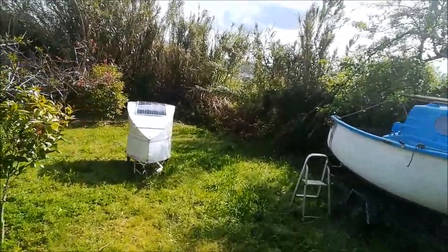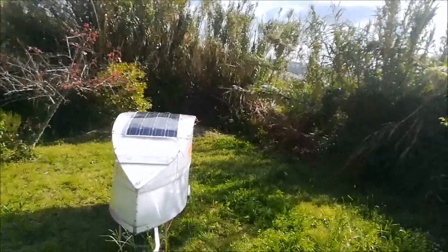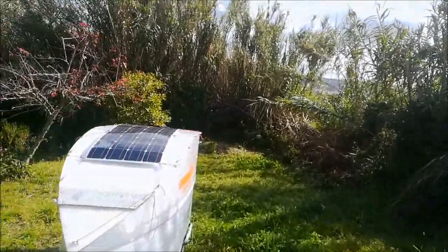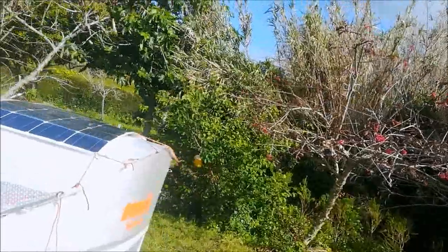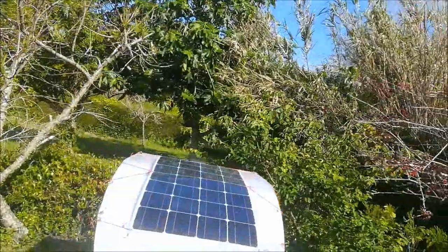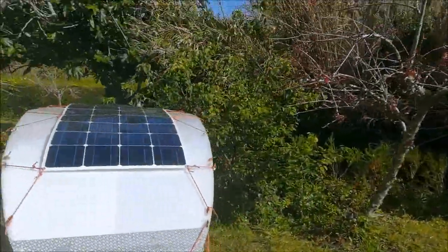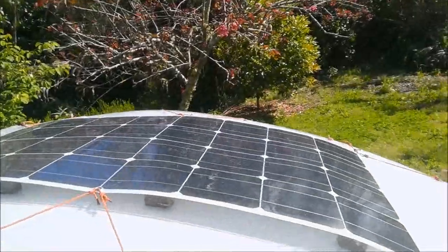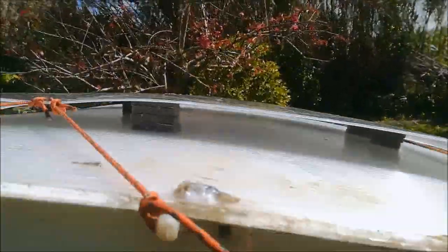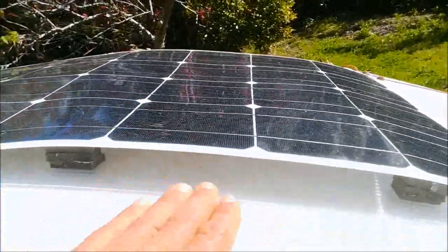It's now 10 AM. Yesterday I left the battery inside the trailer to charge — I left it at about 5 PM, but in this spot the sun only shines until about 6 PM. One thing I noticed is that I forgot to turn the trailer towards the east for a better angle to the sun. The battery says 37.1. Notice how I have the panel spaced away from the camper — it's for two reasons: so the panel doesn't overheat, and also it gives some shade to the camper itself.